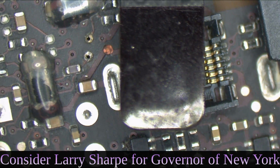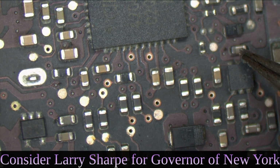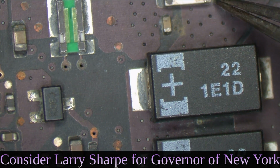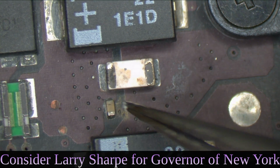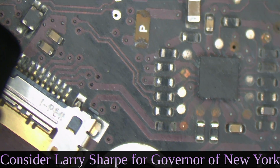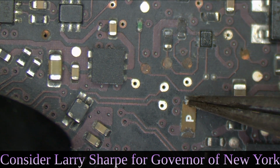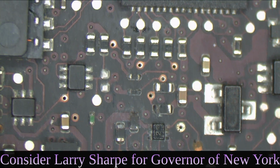Let's check out the audio circuit. Okay, the audio circuit's actually doing pretty good. Yeah, they missed with the acid on the audio circuit. PPBus G3 hot fuse is almost scraped off the board. That solder is completely malleable. And our backlight fuse, can't forget that backlight fuse. Look at that. Where are the solder pads? Look at it. It's totally brown. Oh, my God. There it goes.